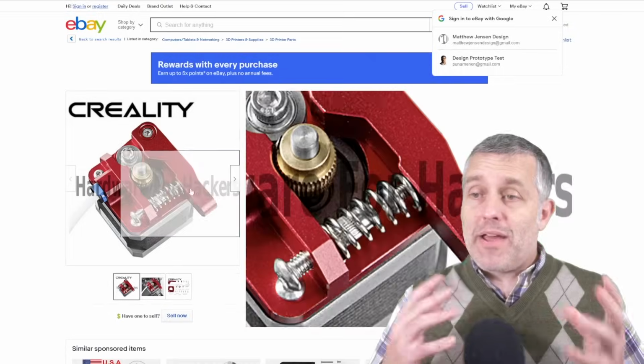You'll have enough tension. First of all, overtensioning exacerbates that pulsation problem that I was talking about, which leads to the sort of lines on your print. But also, overtensioning will be what puts the extra pressure on the plastic capstan mechanism, which will cause it to fail. So there are many solutions here.